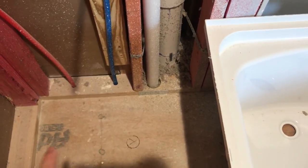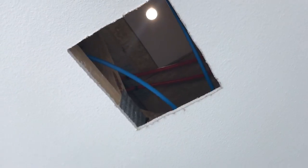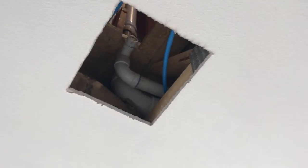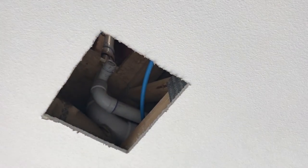Then we'll get the floor cut and see how it all sets in. I hate to repeat work, but it's done. So you see I've got a hole — you're looking upstairs. I had to cut a hole in the subfloor upstairs and a hole in the ceiling down here, with the goal being that little tie-in right there is where my tub drain has to hook in.